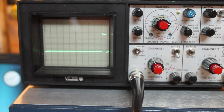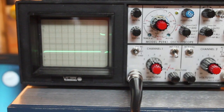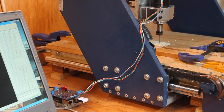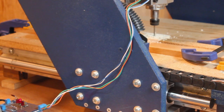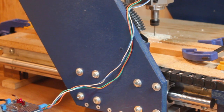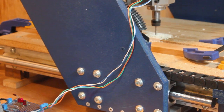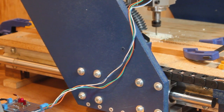After completing the two pocket cuts, the G-code tells the CNC machine to spiral drill holes for quarter-twenty screws in the middle of each of these pockets. You're hearing the machine beginning the first of these holes now. Watch the speed LEDs as the spindle hits solid wood.